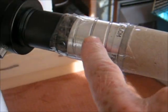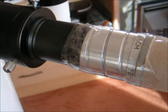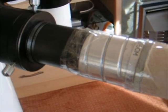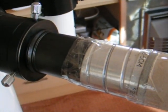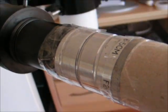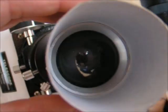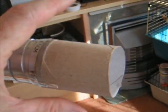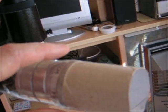I've taken the eyepiece off and instead put on this lens which probably came from a projector. It's a very long focal length — 8.5cm or 85mm — which is about three to four times longer than the average eyepiece. This gives a much smaller magnification but a massive field of view, and that's what you need for a camera. I've put a tube here made from a toilet roll paper cut to length, and the camera fits inside this tube.